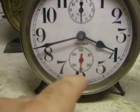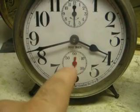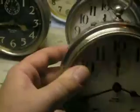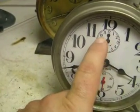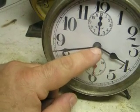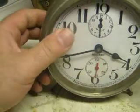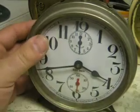The fourth wheel is located in just the perfect position for mounting an extension and then mounting a seconds hand. And I made this by scanning the dial from this clock here and copying the alarm bit and superimposing it down there. The distance from this hand shaft here and the shaft here is exactly 1 inch. I still need to finish it off. I never got beyond this sort of mock-up phase here, but not bad for a parts clock.